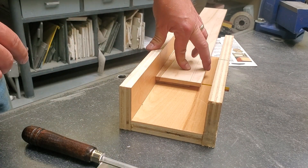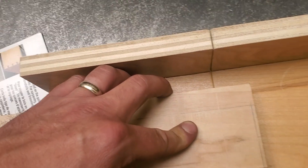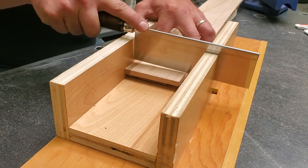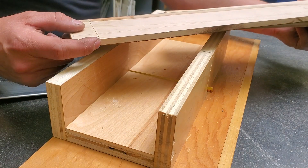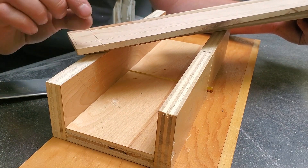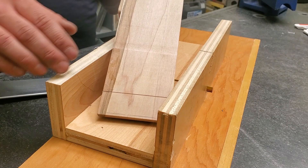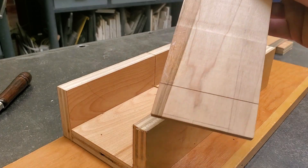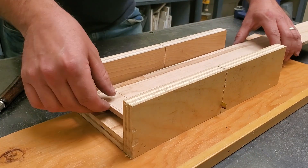At the moment I'm just eyeballing the depth — purposely not going all the way down because I can make them deeper as I go. That allows me to get a nice straight line across. I'm not going full depth yet since I haven't received my fret wire in the mail. I'll go back and bring them down another millimeter or so as needed. After that's done, I'll taper the whole board and shape it to my desired radius — I'm going to do a 10-inch radius for this one. That initial cut is pretty nice and straight, so I'll go ahead and do the rest.